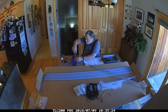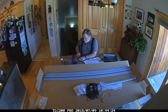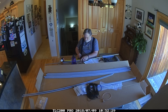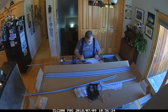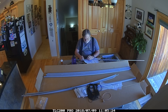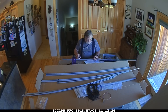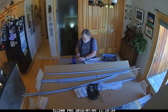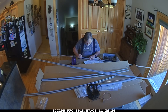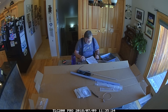Each arm has to have several little connectors where you slide the antenna elements through. I decided to do this in an assembly-line fashion rather than completing each one individually, since I was repeating the task six times per half. These are little loops that the actual antenna elements can slide through as the wind blows. I'm now working on the thicker poles — plastic spreaders — and connecting the thinner arm with the thicker arm. They fit right into each other and a screw holds them in place.